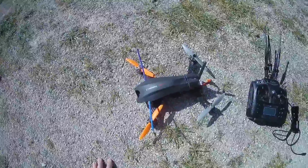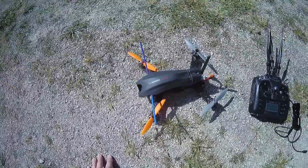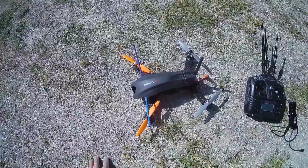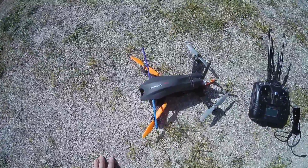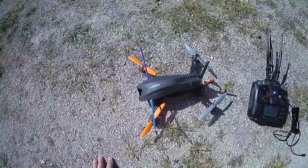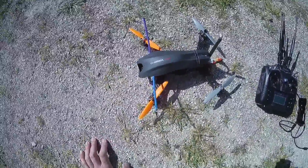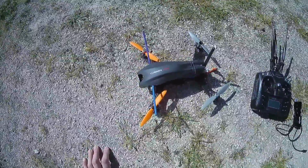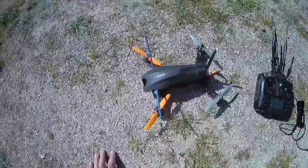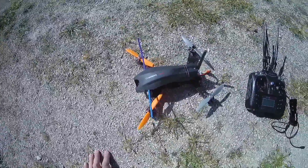It means that sometimes when you power the quadcopter with the LiPo, the flight controller board is not completely powered, so it's impossible to arm the quadcopter. And of course, each time I connected it to the PC, thanks to the 5 volts of the laptop, I was able to arm the quadcopter. So it took very long to understand that.